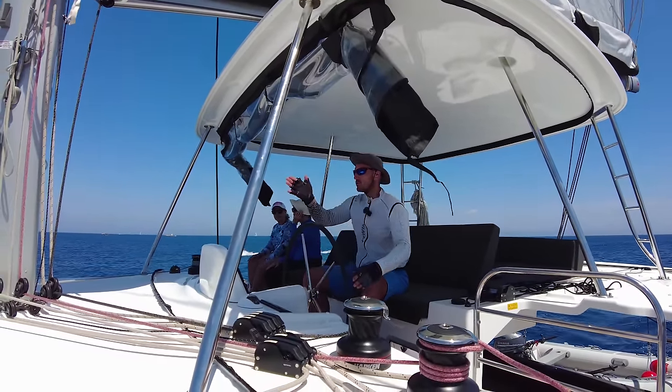So I'm waiting for the fuel station. And there's this big yacht there, and then this catamaran is waiting. And so the wind is coming from that direction. Now, the catamaran behind us is basically facing upwind, and we're facing downwind. You see, we're turned the opposite. And that's a good trick, because it's way easier to control the boat and use less engines, because the engines are on the back of the boat. So I just keep them in reverse. And because reverse, they're a little bit less efficient than forward, just because of the shape. I just, you see, the boat is just stable. I'm not doing much. You see, just floating.